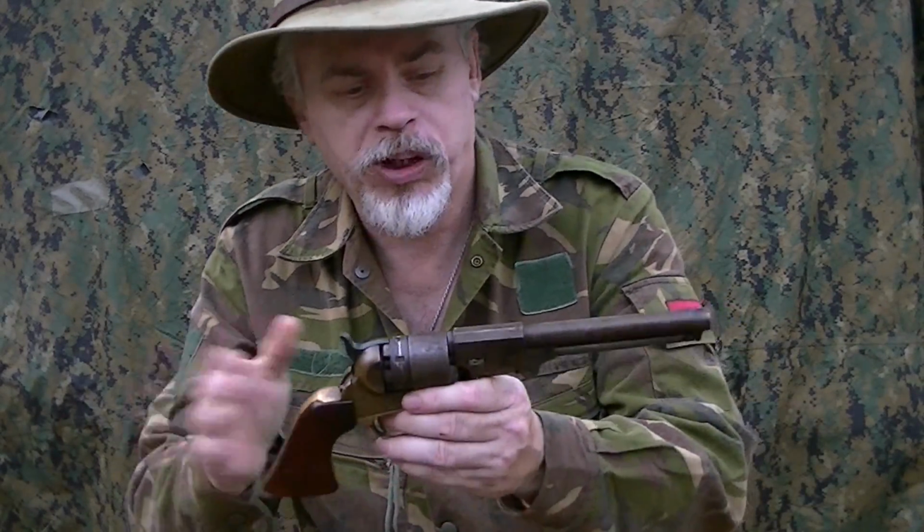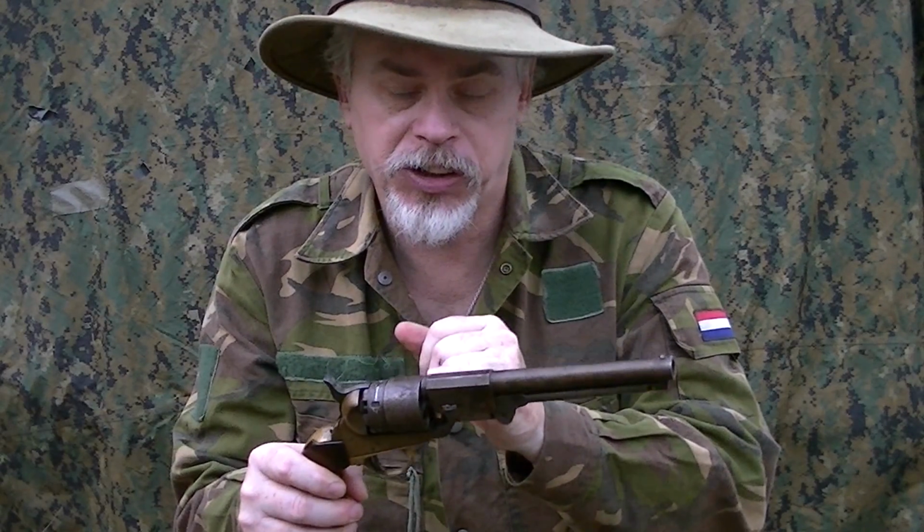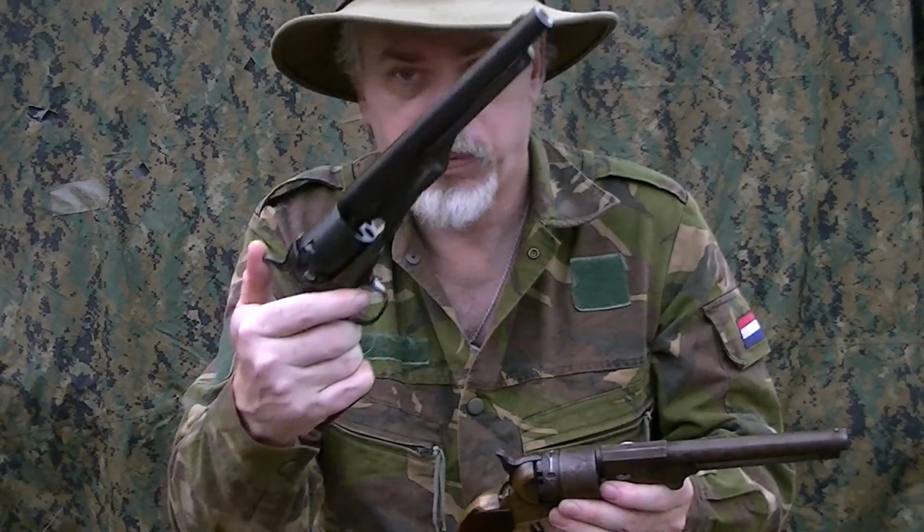Now, old Johnny Reb here is, like I said, I bought it in the 1970s. God knows how many rounds I put through it. And eventually, yes, it has shot loose. It's the metallurgy of this. This is not truly brass. It is actually a gun metal, and it's a bronze alloy, we'll call it. And so, it is softer, because you bought the cheapest gun. Those that are $125 on sale, you can bet it's going to be the cheapest brass. They're going to shoot looser, faster. On the other hand, if it is a gun that is a higher quality, they probably have put the money into this and it will last a lot longer. Yes, it will eventually shoot loose. It will never hold up as well as a steel gun, but it does have a cheaper price.